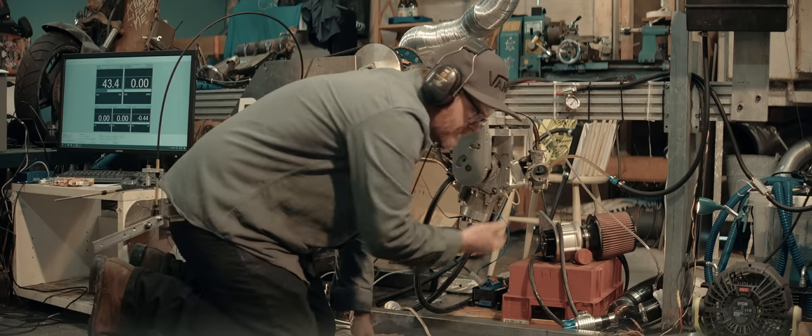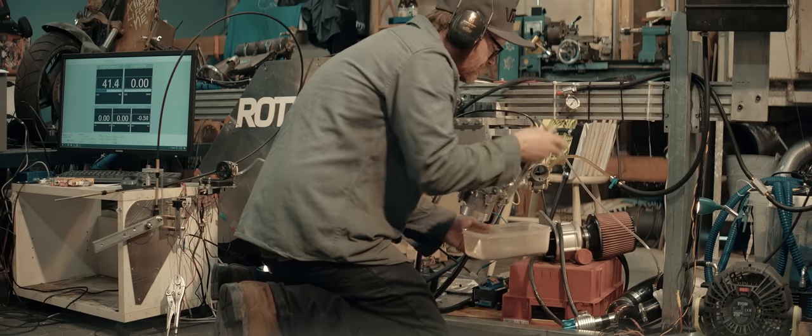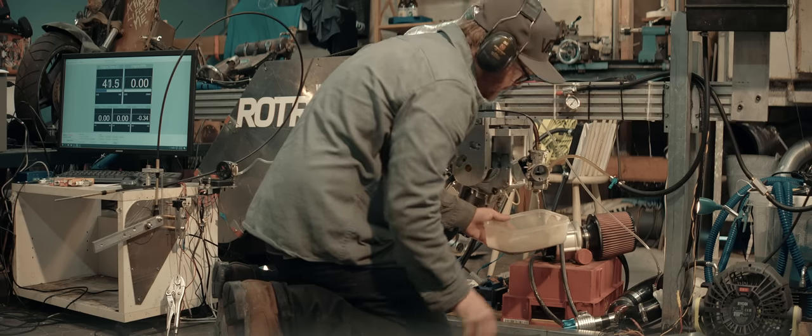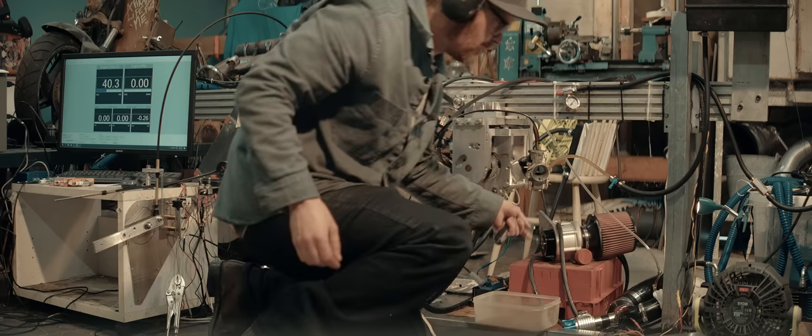Try a smaller main jet and see what happens. All that fuel spewing out of the carb, that's from lots of vibrations at low RPM. Doesn't really bother me as long as it's gone in the power band. 100 jet, we'll see what happens.